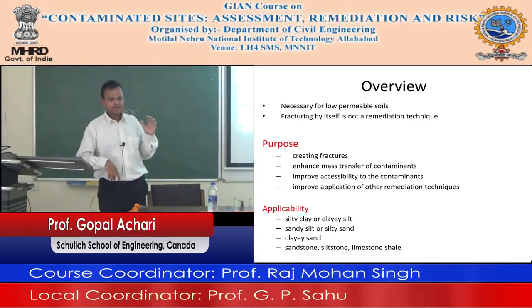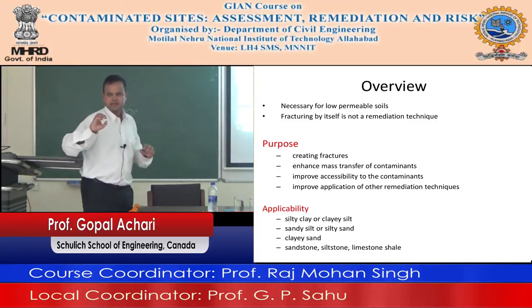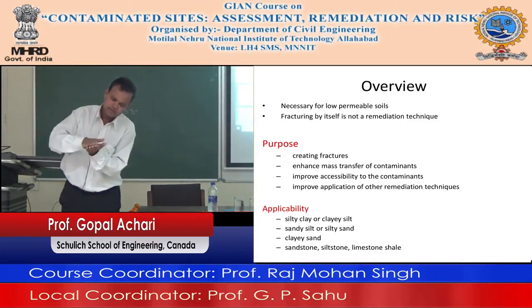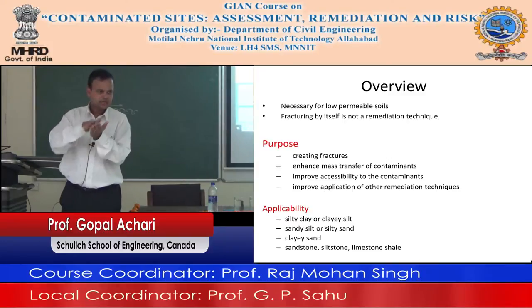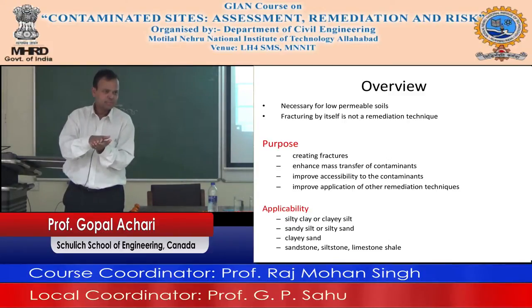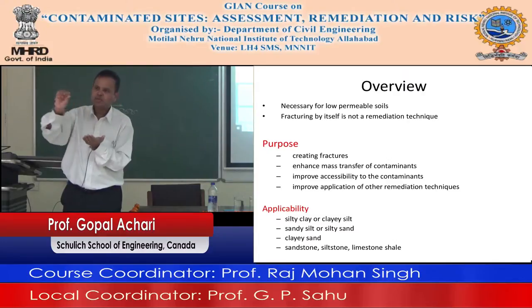If you are blasting water, you would use sand with it. It's basically water, sand, and some chemicals. The chemicals are there because they don't want corrosion to occur. They don't want microbial activity, so some biocide. But the intent is that the sand will keep the fracture open. Otherwise, as the fluid goes, the whole thing might collapse. So the sand will act like micro pillars.